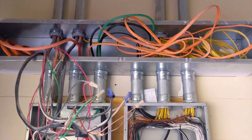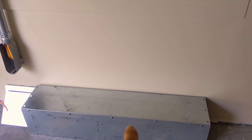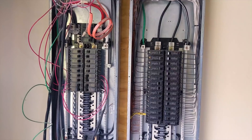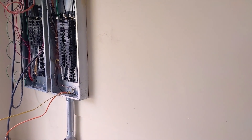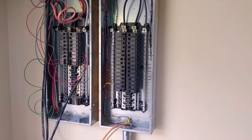This is how we traditionally do it. I put in a nice wiring trough to separate things so we can go back and forth, and then we're going to mount our 10-inch wiring trough over here, connect to this critical loads panel. Solar is going here, we've got Arc batteries on the floor and haven't decided if we're going to use the rack yet. When you're doing new construction or a remodel job, think ahead about solar, generator, or what have you. If you don't put up enough inverter to run the whole house — which you can do now with a Solar Arc, stacking two, three, up to nine inverters, going completely off grid — for most people a single inverter gives a lot of peace of mind and capability. You have 37.5 amps continuous — you can do a lot.